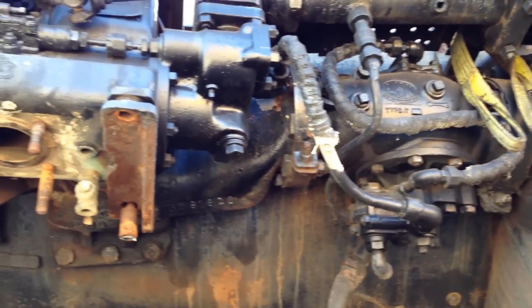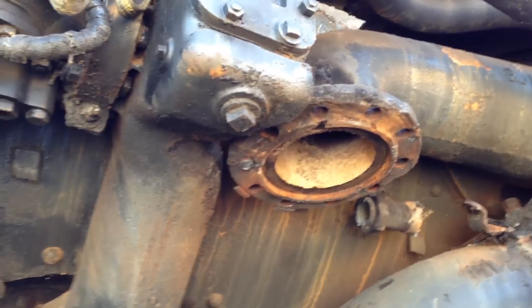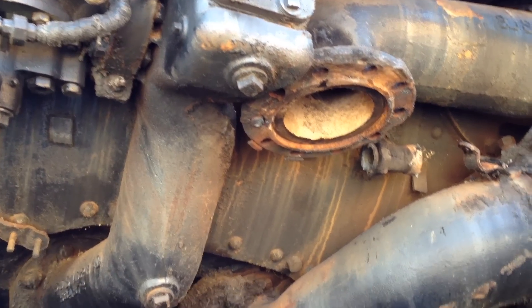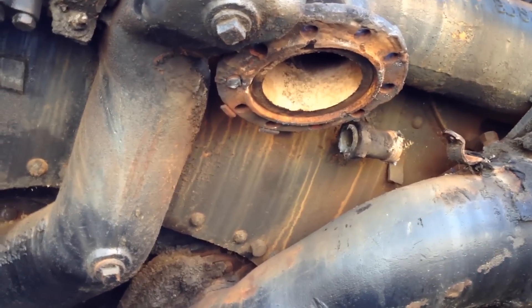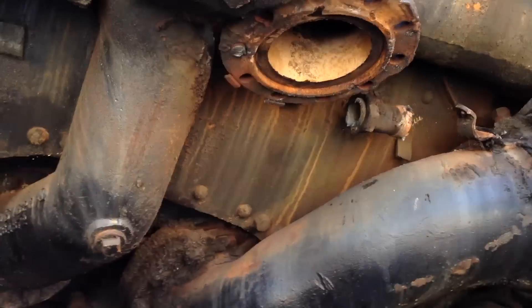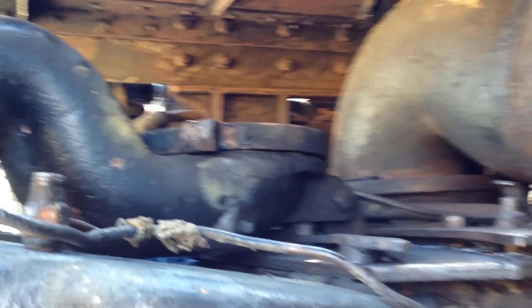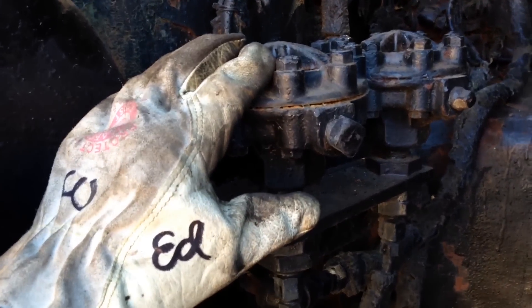Some of the water and overflow piping has been removed in order to allow us to remove the steam connection to the left front engine and the right front engine — two very large flexible ball joints right below this flange fitting right here. There's no practical way for us to lubricate those in transit, as they're lubricated by valve oil injected through a terminal check valve, just like the check valve on my hand here.